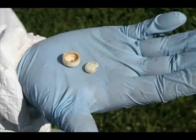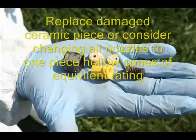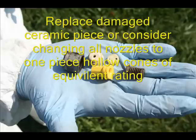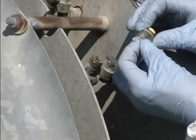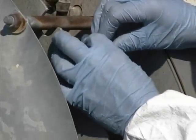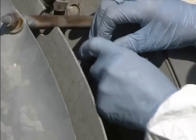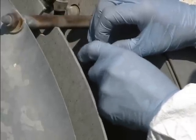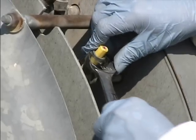Note the swirl plate in this photograph — it's badly damaged and would cause higher flow and an irregular pattern. An alternative instead of the two-piece nozzle tip and swirl plate is to buy one piece. There you see them side by side. Insert the one-piece nozzle tip inside the brass cap. Screw the nozzle cap on finger tight and then use a wrench to tighten. Do not over tighten.